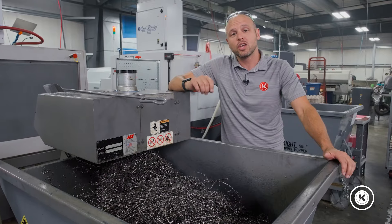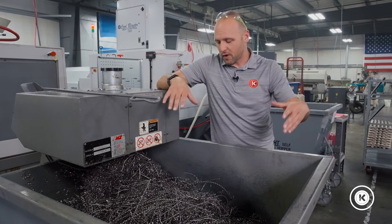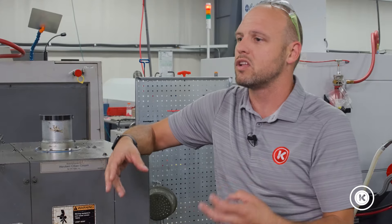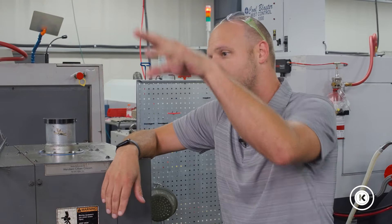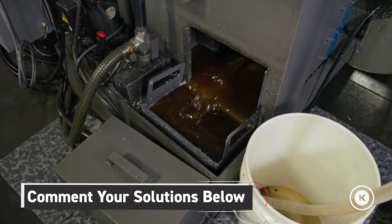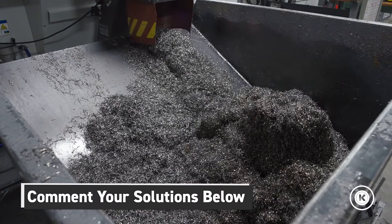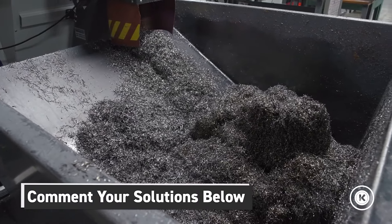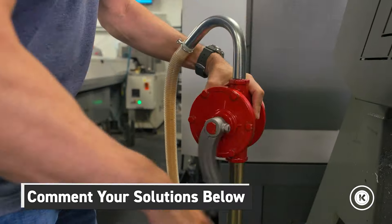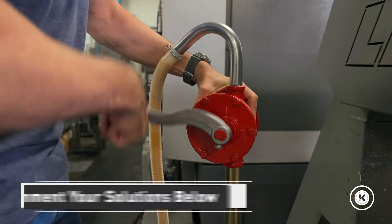So I'm looking to you for recommendations. In front of me, we have hoppers. We'll let it sit, it'll drain out, but we're still losing a lot of oil in our big luggers that go out to our recyclers. We are looking to develop a system — a chip spinner, a conveyor system, something that will help us process these chips, reclaim that oil so we can put it back in the machines and ultimately save us some money.